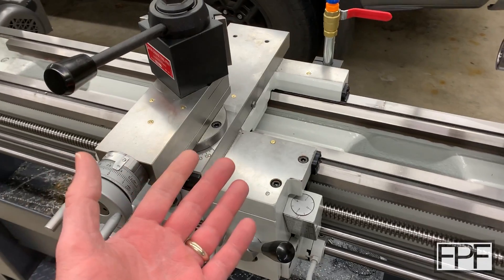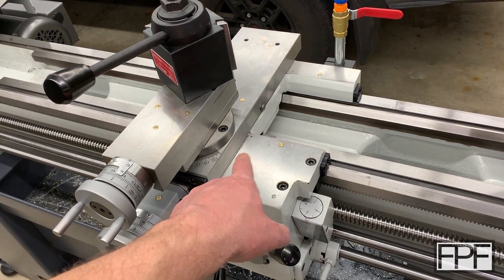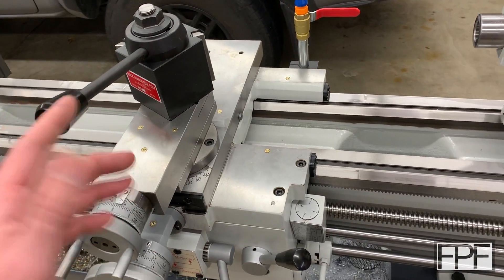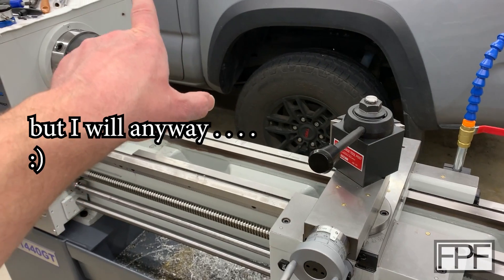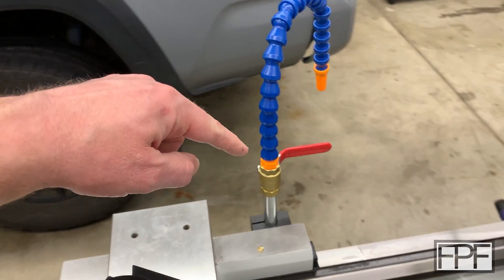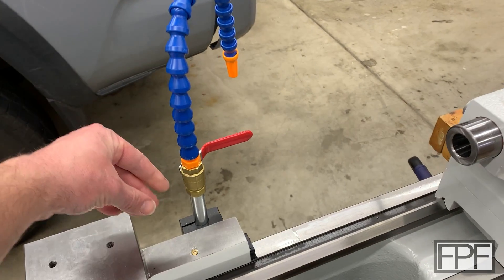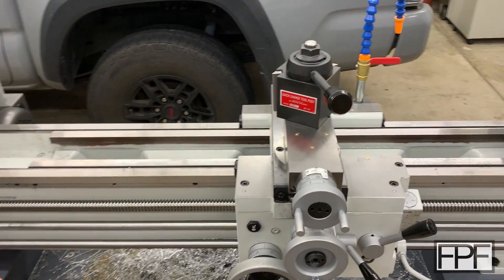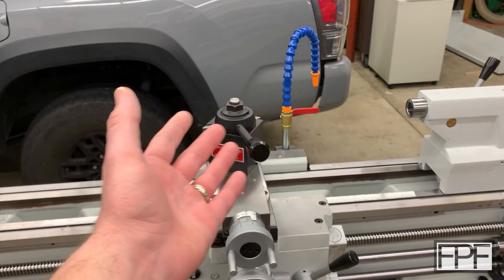Again, I find myself saying that's as far as we can go with this project right now. Hopefully that 0.6mm nozzle comes in and we can get that PA-6 nylon carbon fiber piece done, and get this DRO mount finished up. We also have to figure out how we're going to mount the screen for Touch DRO. The splash guard is off so I don't want to brainstorm that yet — there are a couple holes on the back of the splash guard and on the back of the lathe casting already. I was also thinking about mounting it over here, maybe making a modified piece that accommodates both the riser for the coolant as well as a riser for the screen right here and just having it follow the carriage. I know that's common on much larger lathes, and it still seems like a good place to have the display.